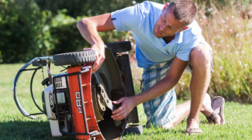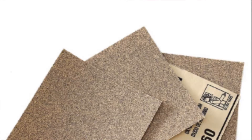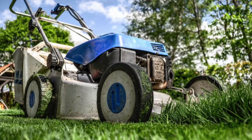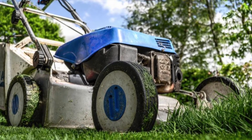If the deck is brand new and has a glossy painted surface, we recommend that you emery paper that surface so it's dull, and allows the binder system to have a tight bond to the deck.